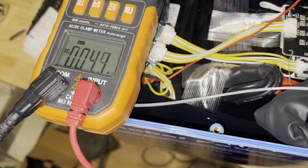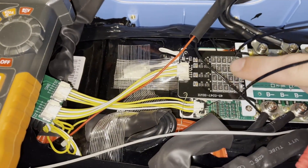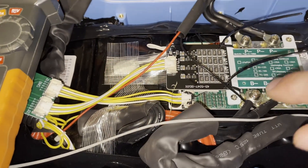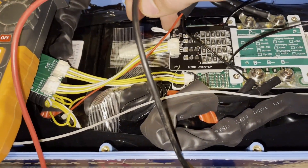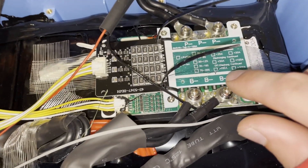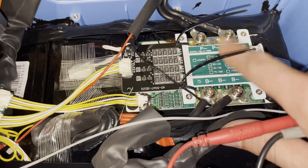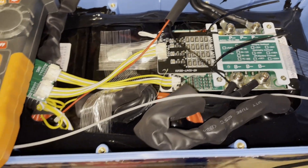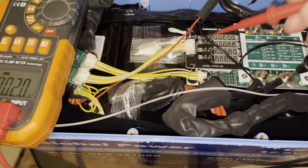The real problem is that the voltage is that low and that that's the actual low voltage. You'll see that I did install the balancer board that the seller provided, with a little splitter, and it's up off everything so it can stay cool — because those resistors get nice and hot when they're balancing. But it looks like something went wrong here, because things should have cut off instead of allowing the voltages of individual cells to get so low.